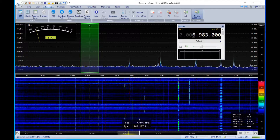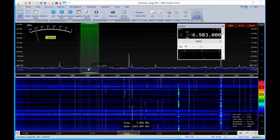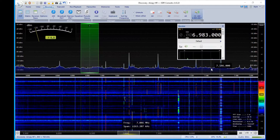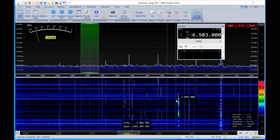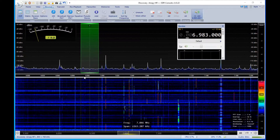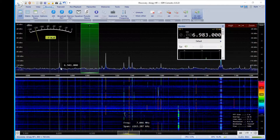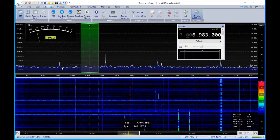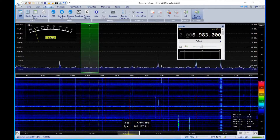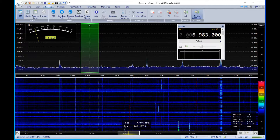Okay, we're back at the ham radio shack computer. Right now we have roughly the same conditions as yesterday - basically minus 125 in the middle of some lightning crashes, so something's brewing up somewhere. I'll let it run for a few seconds so you can get a baseline idea of the noise level, running the six-meter antenna - obviously very short for 40 meters. That ambient noise level at minus 125 shows that. I'm going to run into the other room, put the power supply on with a one-amp load running normally, and then insert that choke - just one component of the RFI filter.